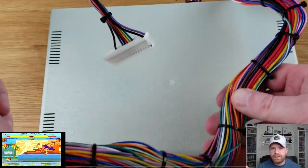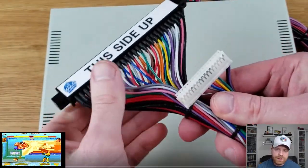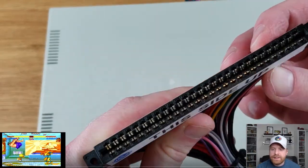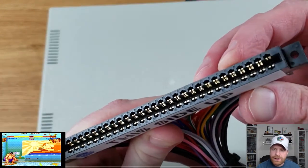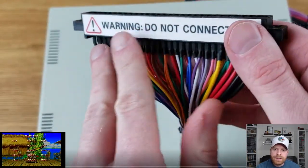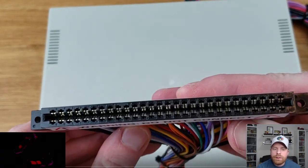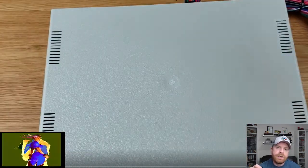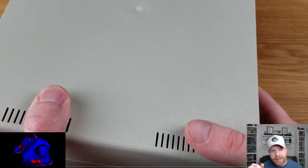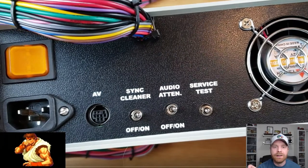If we take a look at the cable coming out the back, this is what plugs into your arcade game. For example, on the CPS2, the little white thing is the kick harness that supports the extra buttons, and this is the main JAMA connector. It says 'this side up' — you can see all the pins — and on the bottom it says 'do not connect.' It's nice because it lets you know which side to connect and which side not to. I would have liked to see a little piece that could slide in so you could only connect it one way and didn't accidentally plug it in wrong. So just be very careful when you are plugging it in.